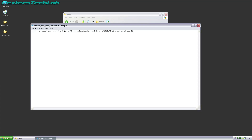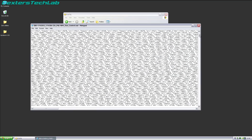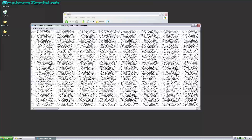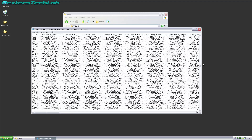The number on the end is what tells the analyzer which pins are output pins. If you don't put that on, it will work out what those output pins are and report back saying okay, please run it again and add E1 or 37 or whatever number it is to tell the analyzer which are output pins. Once that is done it doesn't report much to the screen - it literally goes away and generates some rather large files. This one here is about 1.2 megabytes, so that's all the input states and output states. This is all the data which later gets analyzed and somebody more clever than me will work out how the device has been programmed.